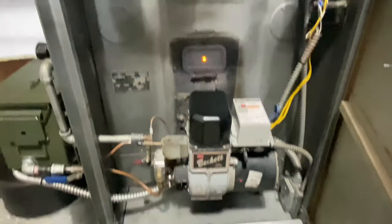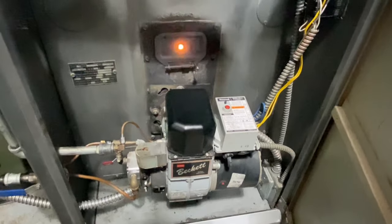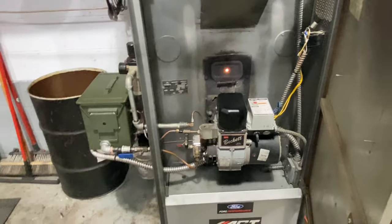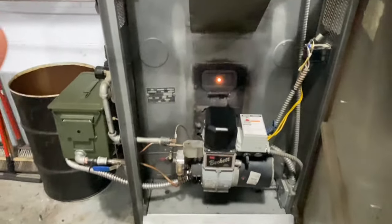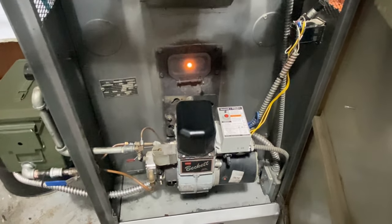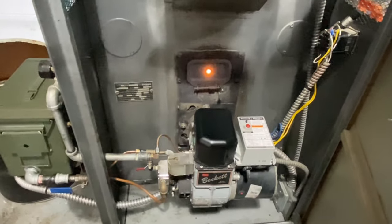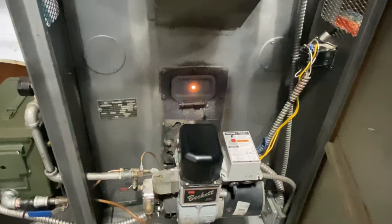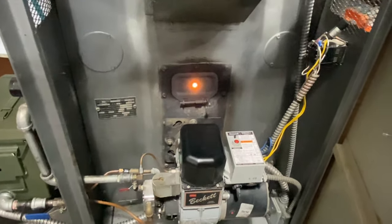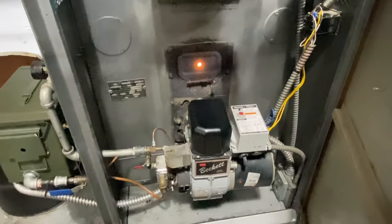You also have full control of your air, so if you're having an atomization issue, dealing with thicker or higher viscosity oils, or having any kind of trouble, you can adjust all these things. It's a little more complicated for someone who just wants a simple set-and-forget system - if you want to just turn it on in the morning and forget about it, you'll probably want to go with the standard siphon system. But I like this because I come into a cold shop - whatever the temperature is outside, 10 degrees, 35 degrees, negative temperatures - I can go from cranking out the heat to backing way off. Once I turn it on, it stays on all day and I just adjust the flame.